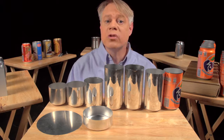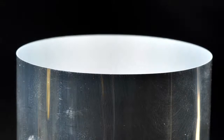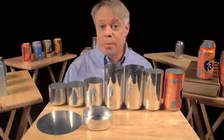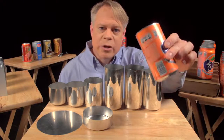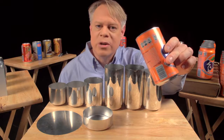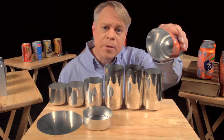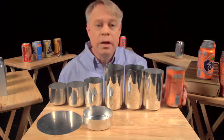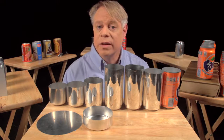If you look closely at the top of the can body, you see that the edges are wavy and uneven. These irregularities occur during the forming, so about 6 millimeters is trimmed off of the top. With an even top, the can can now be sealed. But before sealing, a colorful design is printed on the outside — the term of art in the industry is decoration. The inside also gets a treatment: a spray-coated epoxy lacquer separates the can's contents from its aluminum walls. This prevents the drink from acquiring a metallic taste and also keeps acids in the beverage from dissolving the aluminum.